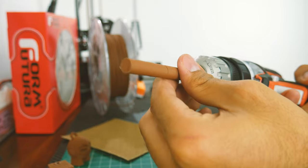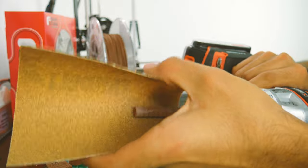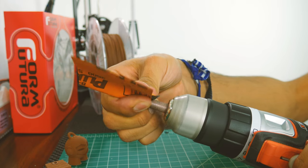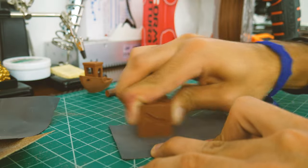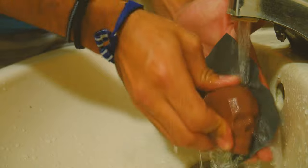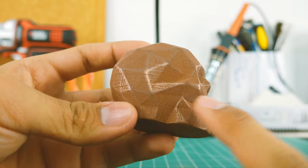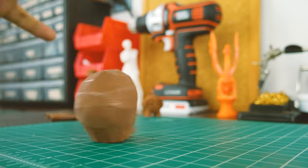Then I tried sanding paper. To save time, I placed the printed cylinder in my drill and rubbed the sanding paper on it. I started using 100 grit, then moved to 1000, then 2000, and ended up at 2500. This kind of worked, but the copper seemed quite dark — I thought heat caused by friction might be the problem. To solve the darkness issue, I tried wet sanding. This actually worked and made the prints shinier. Yet getting all spots using sanding paper is quite hard and time-consuming. I like how the prints turned out though. At this point I could wax or grease the prints, but it's not like I polished them in a rotary tumbler.